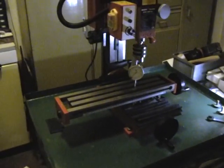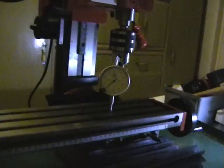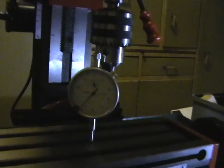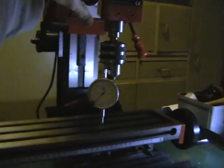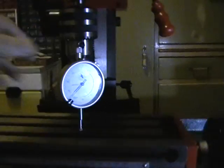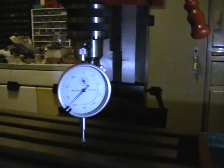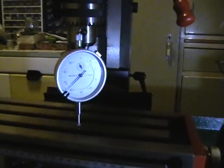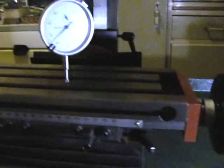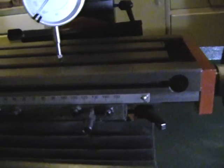And yet there is some truth to the horrible Chinese-made crap argument. Here I have a dial indicator on my machine. And if I press against the machine with my hand — maybe if I put the face into the light you'll see better — I'm getting about 10 hundredths movement just by pressing relatively lightly on the machine. If I wiggle here, it moves. That's the height changing. The height should never change.